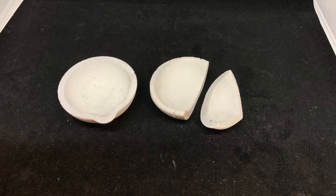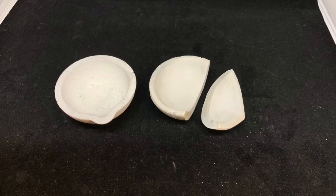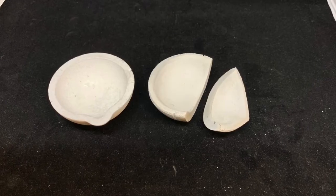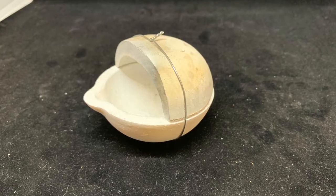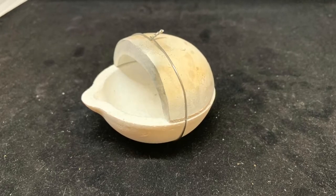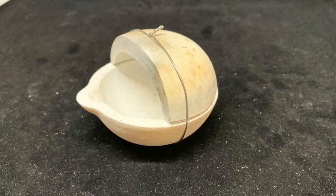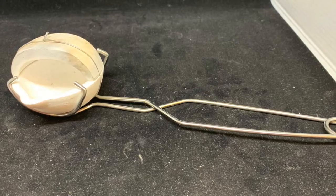Using a one-piece or two-piece hooded crucible will greatly aid in keeping the metal constantly covered by the flame. It is easy to make a two-piece hooded crucible by taking a second crucible and cutting it with a diamond saw to make a matching cover. A couple of grooves cut in the lid and the crucible will allow you to use stainless steel wire to bind the top onto the crucible to aid in keeping it in place while melting and pouring.